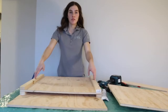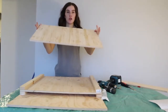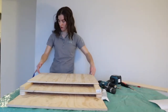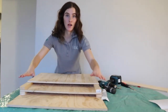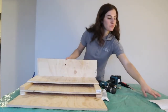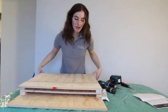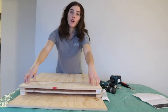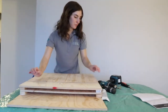Once your two side pieces are on, you can start putting on the top. This top piece is shorter than the middle piece — you'll want the top end to line up with the top of your box. You'll notice there's an extra bit exposed at the bottom; that's where the six-inch piece of board comes in. You'll put this board leaving about a half-inch gap there. I'll caulk these on, screw them in, and then I'll show a close-up of how the box assembles.